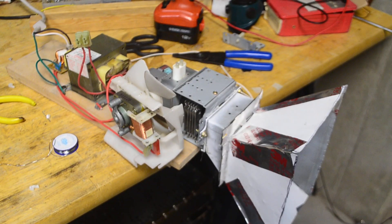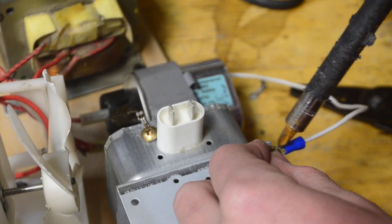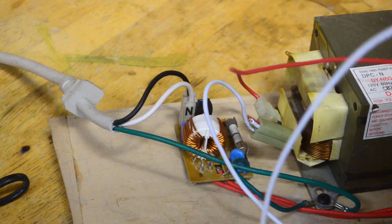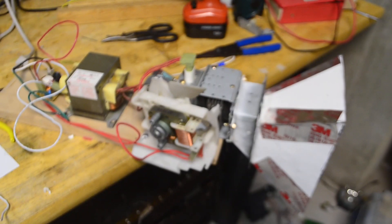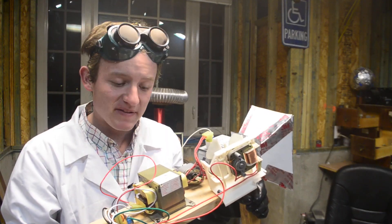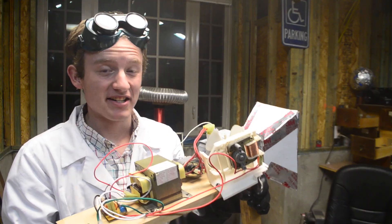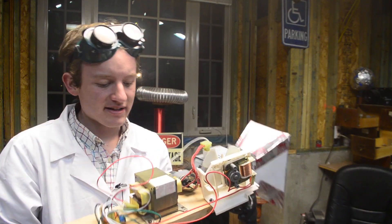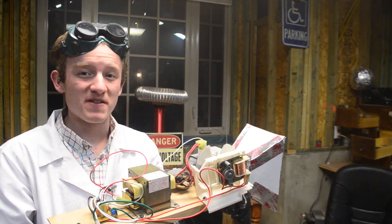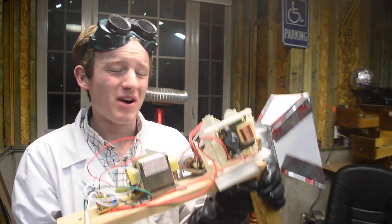Now all that's left should be attaching the magnetron, using these small holes down here to secure it onto the board. Now all that's left is to connect everything up. I need to get the ground connection onto the magnetron, so I'm going to connect the free end of the diode onto the body of the magnetron, and also connect this wire from the body of the microwave oven transformer onto the body of the magnetron. And lastly we can connect these terminals onto the microwave transformer, and then that connects back up to our noise filter — and now our magnetron gun is complete. I added two handles on the bottom just by cutting wood and screwing it onto the top. Now something you really need to know is about the safety of this microwave oven transformer: it outputs over 2000 volts along with a very high current — in other words if you touch the output of that transformer you're practically going to die. Never under any circumstances touch any part of the circuit while it's turned on. Even on the low voltage side it's still 120-volt mains and that'll be very painful. Do not try this because it's very dangerous.